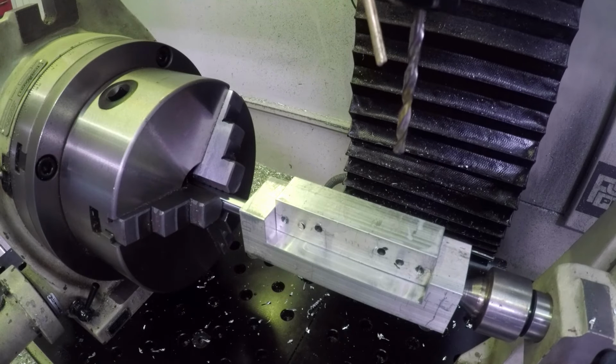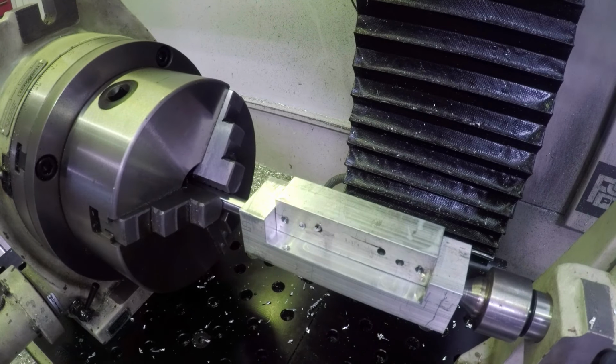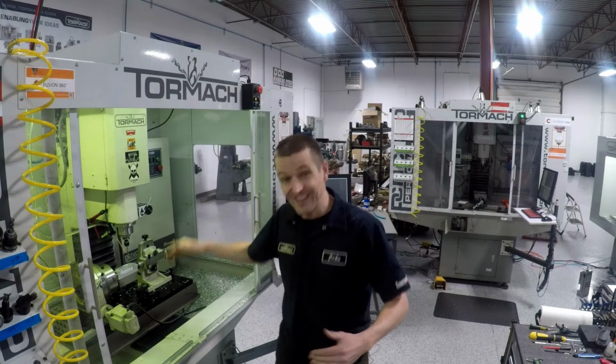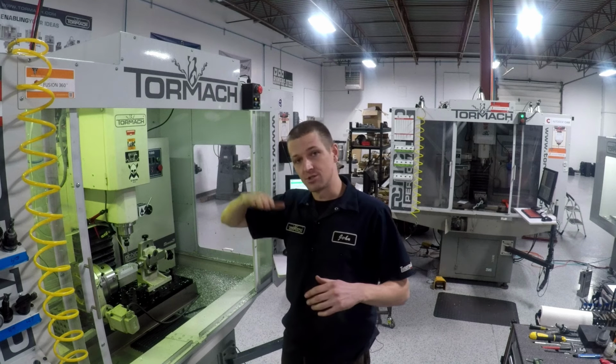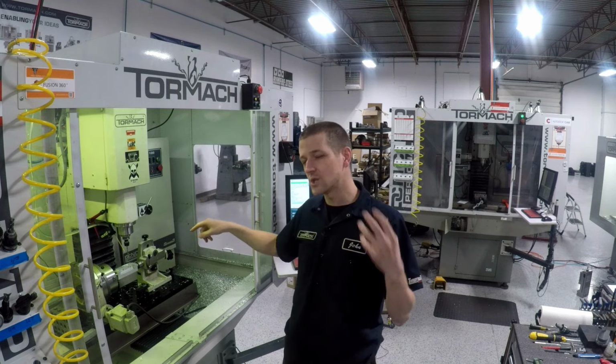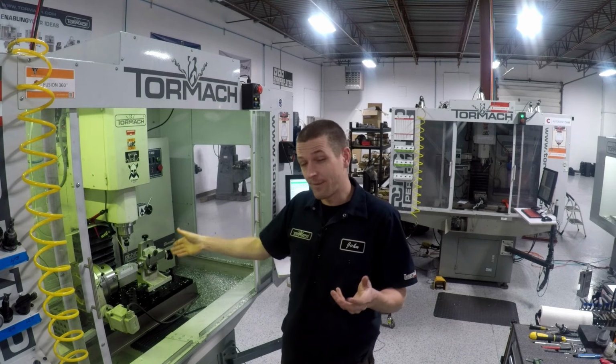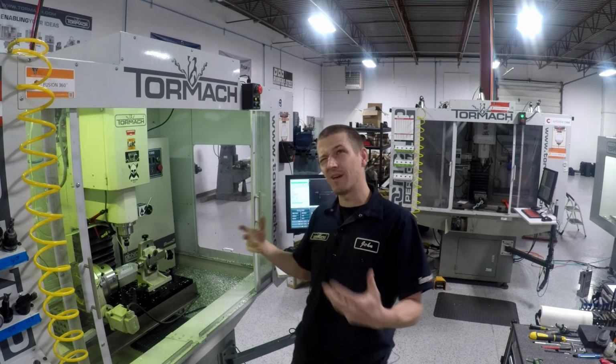That's not good. It should not have rotated before it retracted there. But it worked! How awesome was that? I definitely saw some stresses and some pushing and deflection on the trunnion, especially toward the end. So I wonder if changing the speeds and feeds or even freshening up that drill could help. You know, how do I make that a more rigid system?